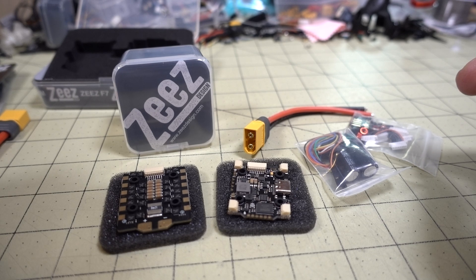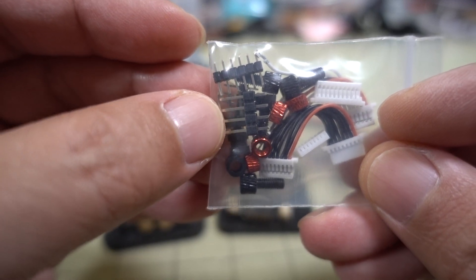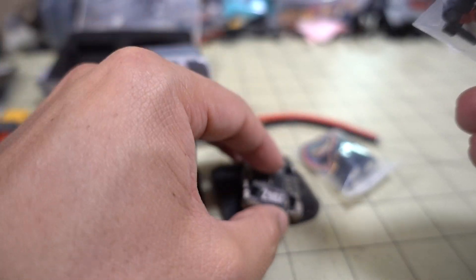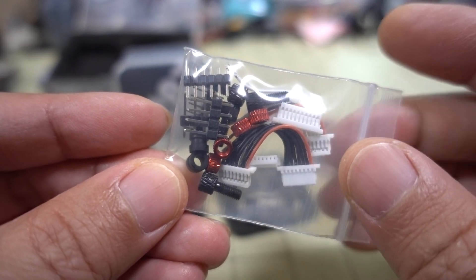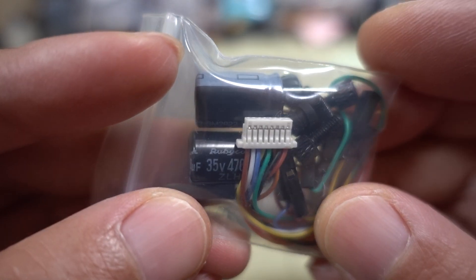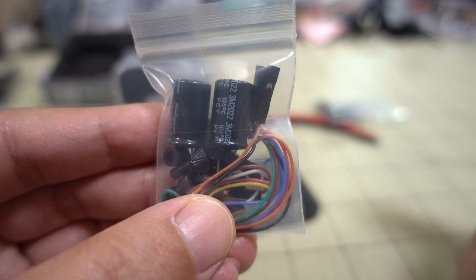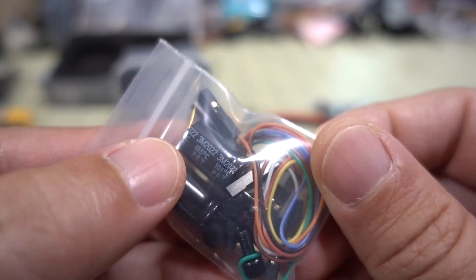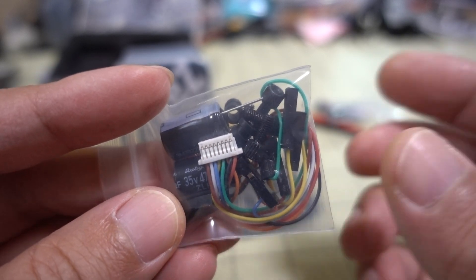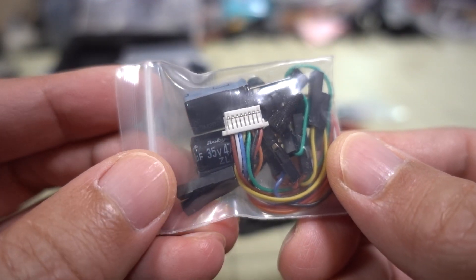Now let's look at the 20x20 stack. It has an XT60 connector and wiring looms — one going from the ESC to the flight controller. You also get your pin connectors, presumably with the same idea for mounting the Crossfire and Unify. You get mounting hardware, extra grommets, screws, extra connectors, and capacitors — two of them at 35 volts, 470 microfarads, even though you only need one, so you can add extra if you want more safety margin. There's also a wiring harness for the ESC if you want to use it with other flight controllers, with servo leads you can cut and adapt.